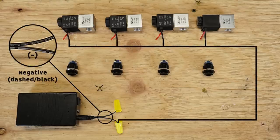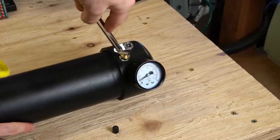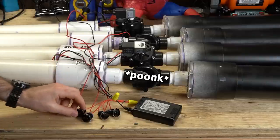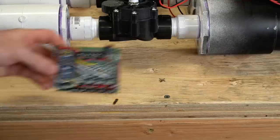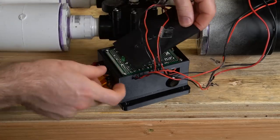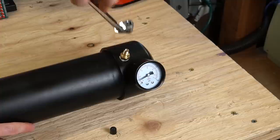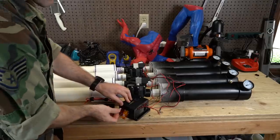For Level 1: attach one wire from each solenoid together with the negative battery plug lead. Attach the remaining wire from each solenoid to a separate button, then attach wires from the opposite side of each button to the positive battery plug lead. Add 10-15 psi to each cannon, turn the battery on, then press the buttons one at a time. For Level 2: start by preparing your circuit board according to the write-up linked in the description. Attach your solenoids and button to the screw terminals of the circuit board — polarity doesn't matter, just make sure to attach the components to their correct terminals. Add 10-15 psi to each cannon, then plug in the battery and turn it on. Make sure not to touch the exposed cable end when the battery is on, as it's live with electricity. This design could certainly be revisited for safety reasons. Once the board is powered on, press the button for cannon glory.